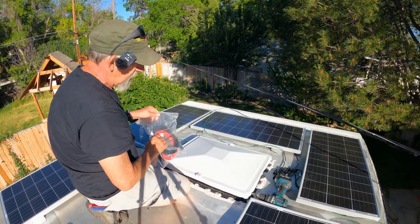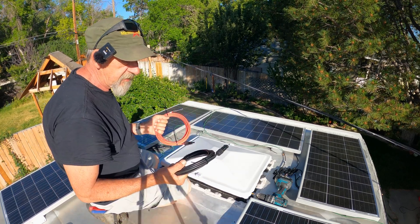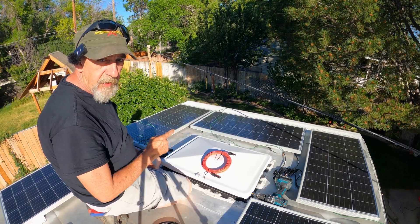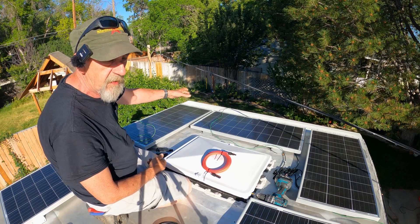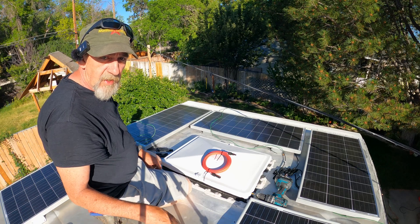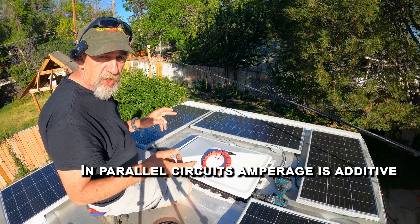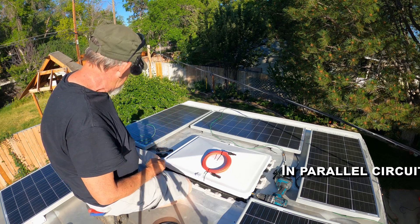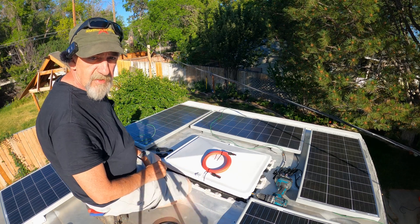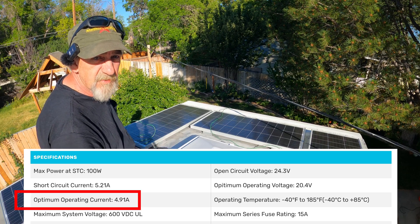It's a new day. I've got parts and pieces here. I bought this 20-foot cable to do the patch cables that I need to finish up this solar. This is going to be a parallel string — all the positives from the panels are going to be connected together, all the negatives connected together. When you're doing parallel, the voltage is constant but the current is additive. So if each panel puts out 5 amps: 5, 10, 15, 20, 25 amps is about what you can expect. I don't remember the exact output on these, but it's pretty close to 5 amps.